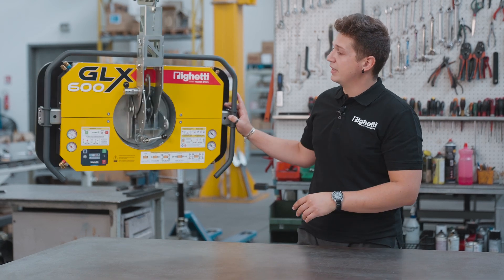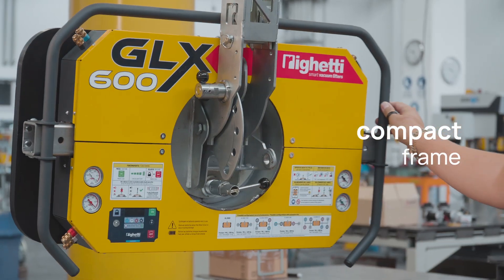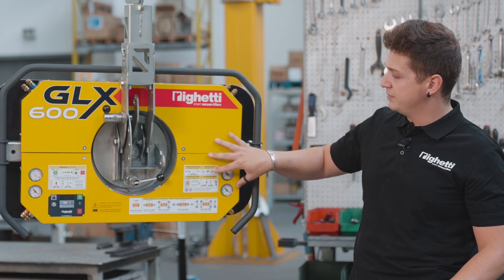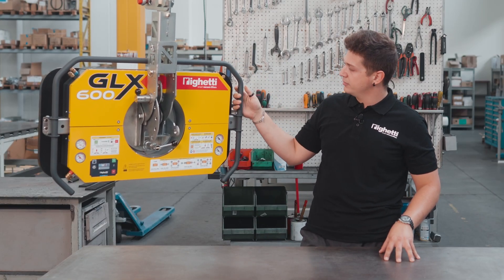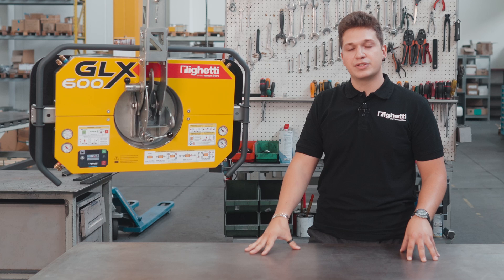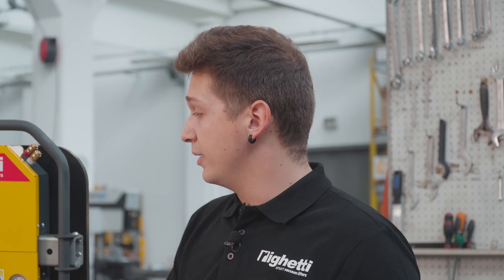As you can see, it has a very compact frame, which is very helpful when you're working in tight spaces such as behind scaffolding. It also has a closed casing with all the components inside, and around the casing there's an all-round handlebar with a rough finish, which gives you extra grip while handling the lifter. As with all our glass lifters, it features a full 360 degrees rotation and a 90 degree tilt, and we worked carefully on these movements to make them as balanced and as easy as possible.